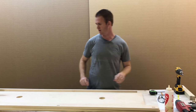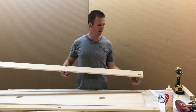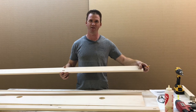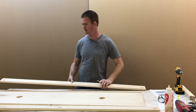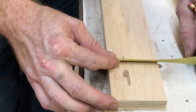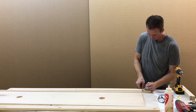To get started I want to make some marks on the header. I'll take the mortises cut in here to help space out and support the top fascia to the top panel, and that gives you the correct spacing of a half inch. If you're building this on your own without the pre-cut boards you'll have to measure up a half inch, but with the pre-cut boards there's no need to measure. I do want to put some marks so I can pre-drill holes for the screws. I'll go to the center of that mortise — it's seven-eighths of an inch — and I'll put a mark at seven-eighths of an inch about every eight to ten inches.